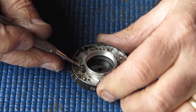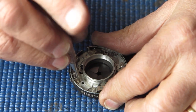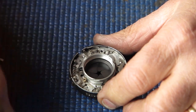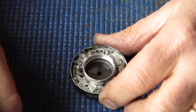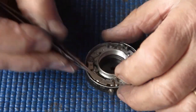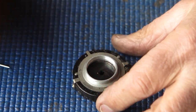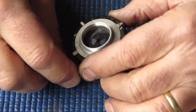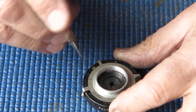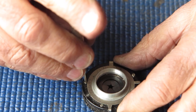This is the B lever — it looks very jammed up. Let's get the B lever off; it's a bit sticky but it looks like it moves. There's a little bronze bush and the lever with its return spring. This little lever can stay in place. The retard gear train swings in and out and that's behaving itself. Let's open it up from the back and have a look at the diaphragm — it's a bit dirty and oily, but nothing terrible.